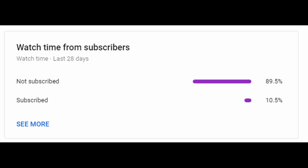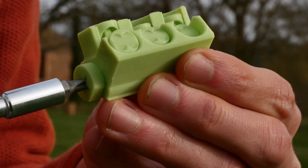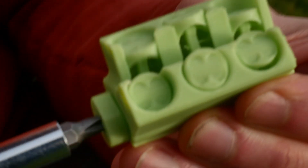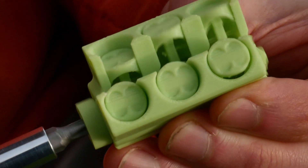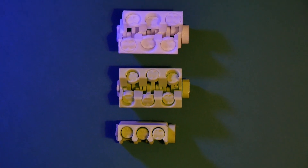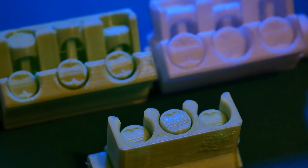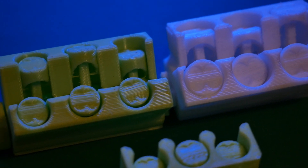And while I have your attention, look at this graph! This V8 uses bigger pistons than the inline engine that I introduced earlier. These bigger pistons are possible due to the V-angle giving more room for each cylinder. You can see in this comparison how a V6 engine is just slightly longer in length than an inline 3, and that extra length can be utilized by simply increasing the cylinder size.